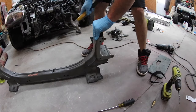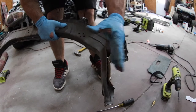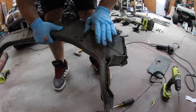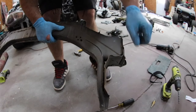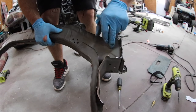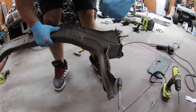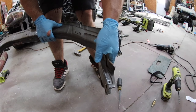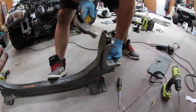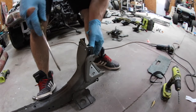Just a couple hits and you can see how this is already separating. The more it gets loose, the more it starts to pull itself away from the piece, and the easier all of this will be. I still might have to drill some and use my flathead. When you put the flathead in and hit it, the round portion will drive down and put like a half-moon curvature in the sheet metal. I don't care if that happens to this piece, but I might indent the other piece and then I've got to hit that edge flat again. If it's boxed in I can't fix it as easily — I can't get to the backside and tap it flat. So I'm going to try to hit it as hard as I can on these pieces first, then use the flathead to chip away the rest of the spot weld. Sometimes you can just wiggle the flathead in there and see if you're even close to getting it to come off.